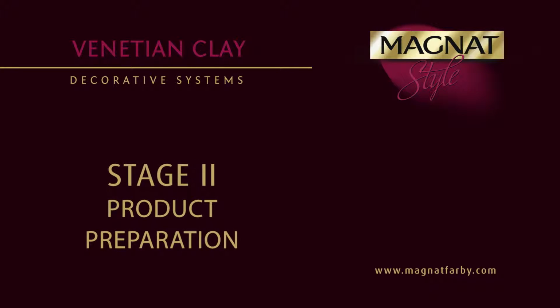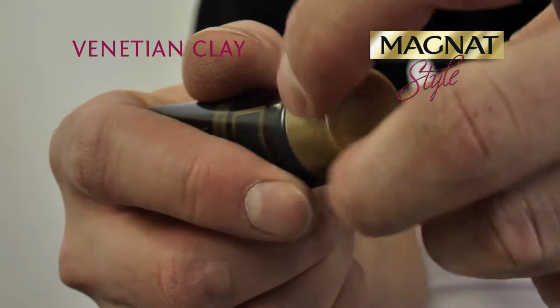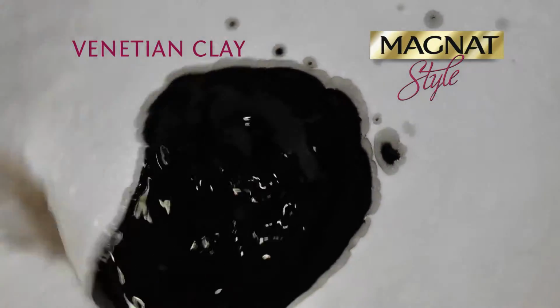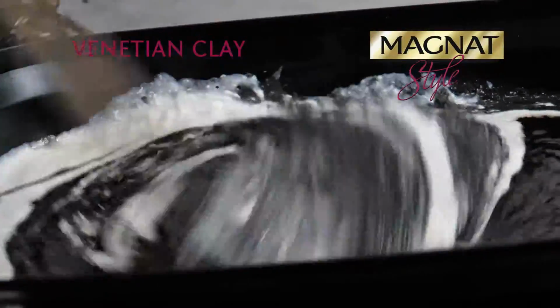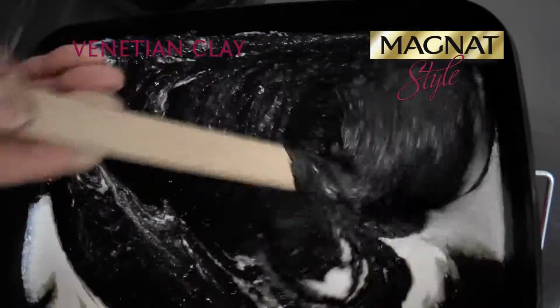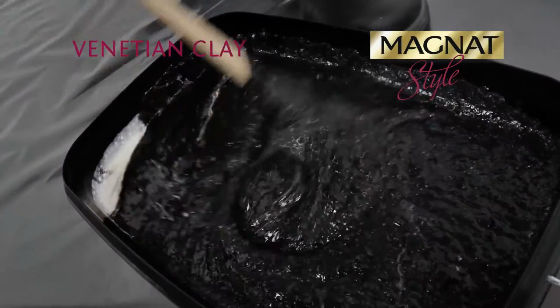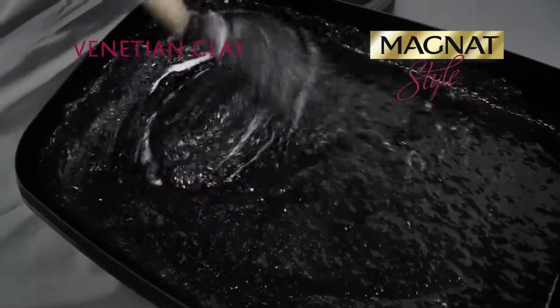Product preparation. Depending on the selected color, add enough coloring pigment to the Venetian clay. Mix the ingredients by hand, being careful not to crush the white particles contained in the product. If you're going to color several containers of the Venetian clay with the same pigment, it's advisable to tint them together in one larger container to obtain a uniform color.